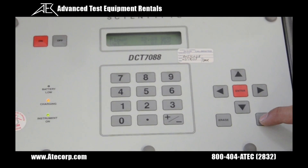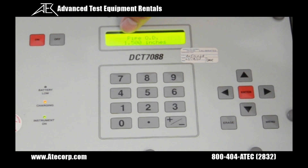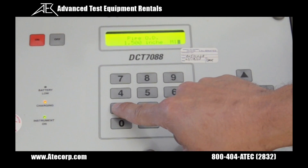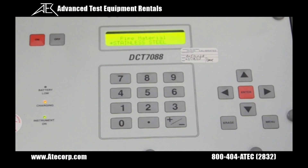We have to set up the pipe overall diameter — go to menu 10, it should be set up to 1.5 inches. Next is the wall thickness, menu 11, it should be set up to 0.1 inches. Next is pipe material, menu 13. For this you can select any material, so it doesn't really matter what material is selected.